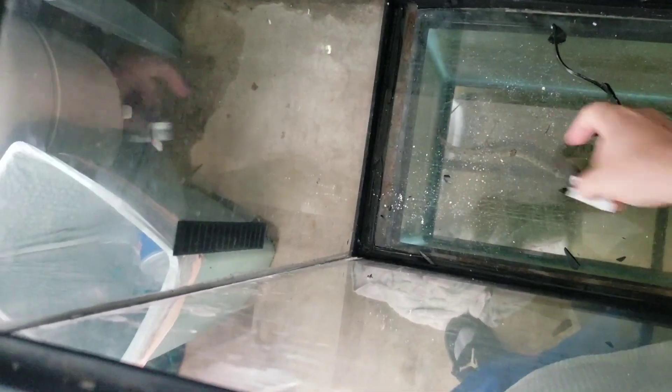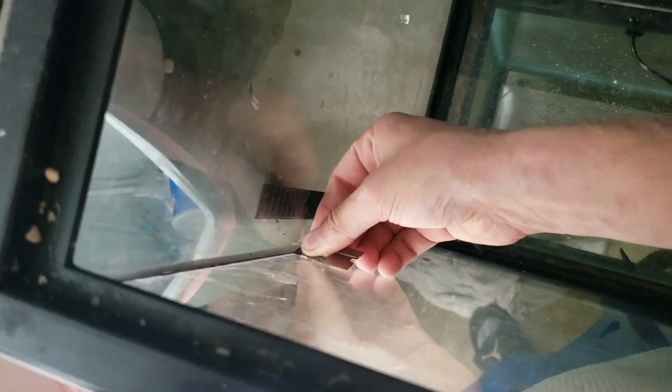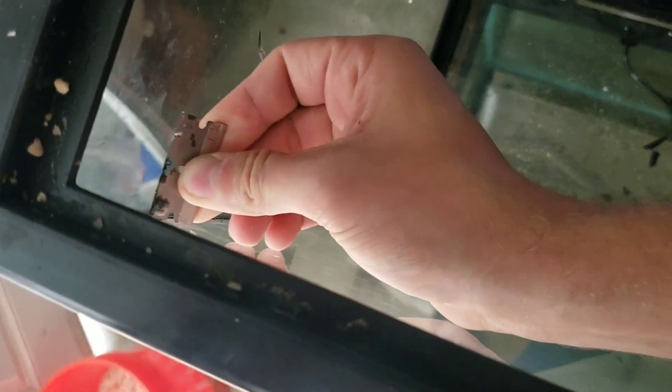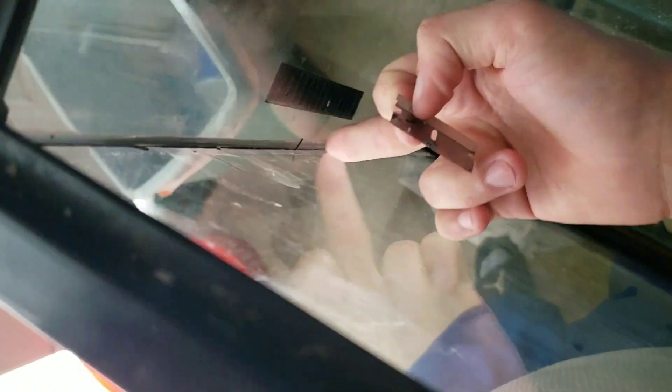Now that your silicone bead is removed, take the same razor blade and go up this glass to clean off any microscopic residue. Get all this off on both sides all the way up until you get all the silicone off that you can with this razor blade. As you can see, nice clean cut corner — it's squared off. You're not gouging into the seam between the two glasses, and then you can just come back and put a new silicone bead in there.